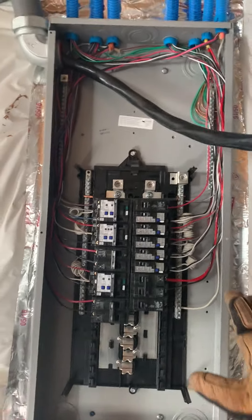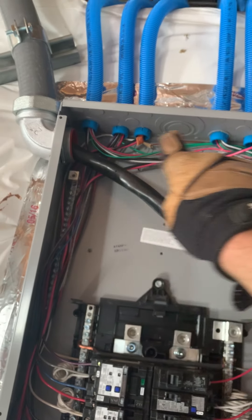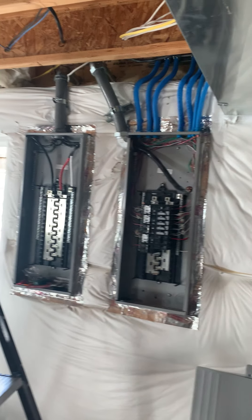If you remember from yesterday, these are all those breakers from upstairs. Carflex came down. Made sure I didn't have more than six to nine current-carrying conductors in my conduits. And I did not use Romex — I used THWN. Then I taped around those panels.